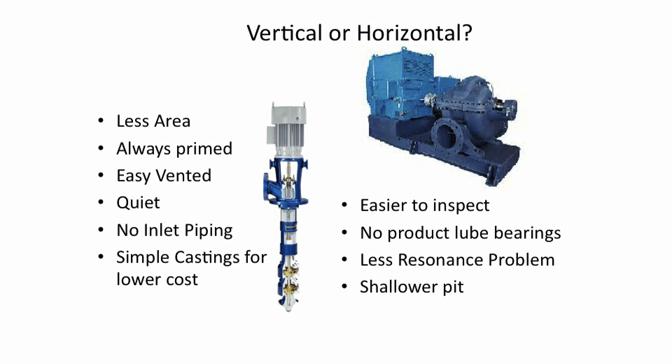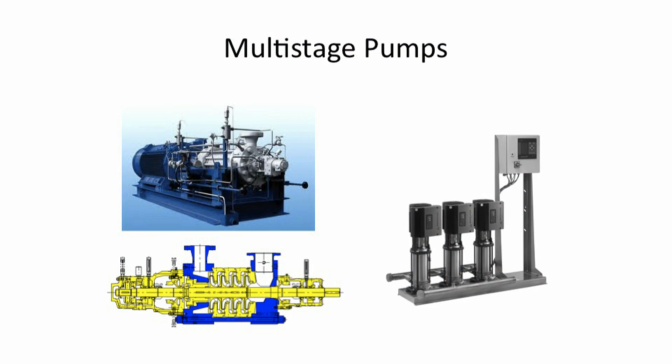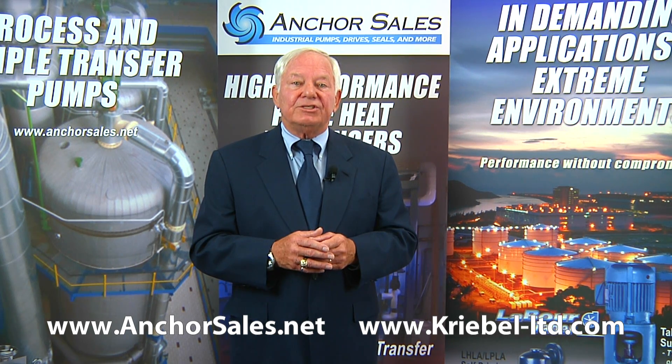This slide shows a comparison between horizontal and vertical pumps for large flow rates. For obtaining high pressure, two or more pumps could be used in series, but it's more practical to use a single multi-stage design to achieve higher pressures. Like the vertical turbine, sets of impellers and diffusers are used to make up the stages.